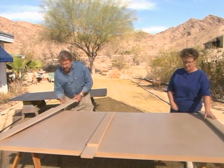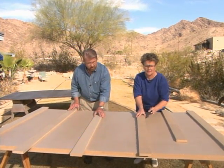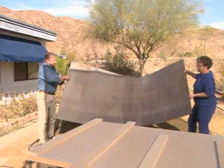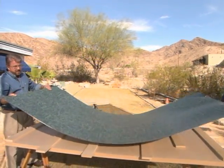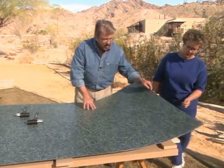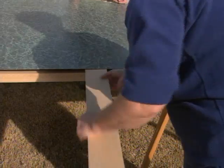Candace, take those boards and lay them on top of the particle board — they won't stick because the adhesive is dry. Now we grab the high-pressure laminate, turn it over with the adhesive side down, and lay it right on top of the boards. The boards keep the two glued surfaces from touching each other, so we can easily move the laminate until it's centered over the particle board.